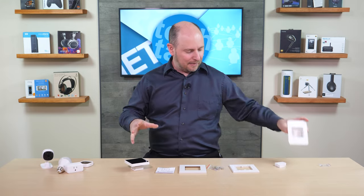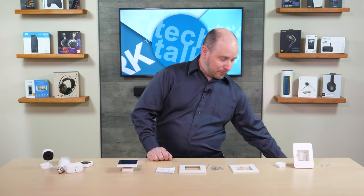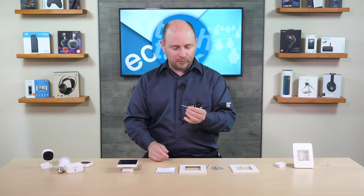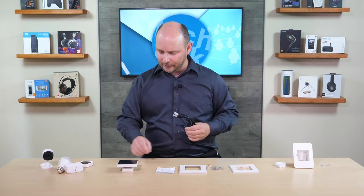Companies like Newbright don't have something like this and have to be wired directly into a wall. This base gives you the versatility to install anywhere you want. You just use a typical power cable with your live, neutral, and ground wires — though it doesn't require the ground, so that's taped off. By running the cable through the back and wiring it to the unit, this can now be plugged into standard power anywhere without going into your wall.